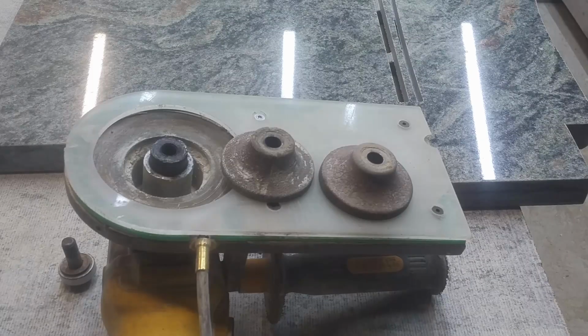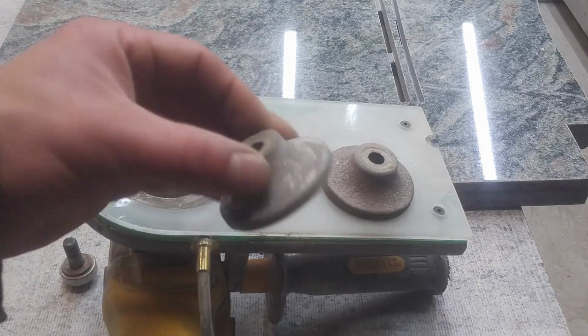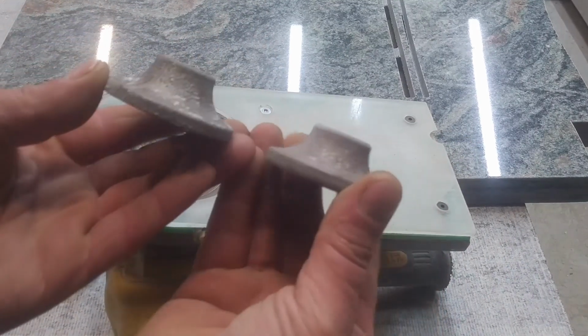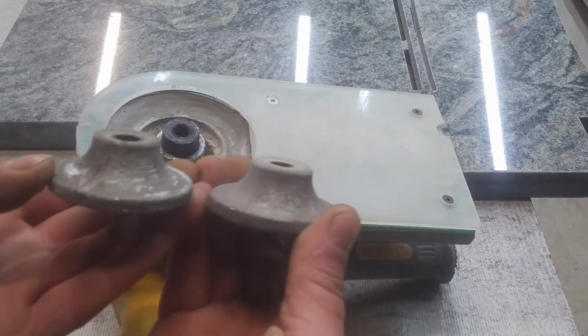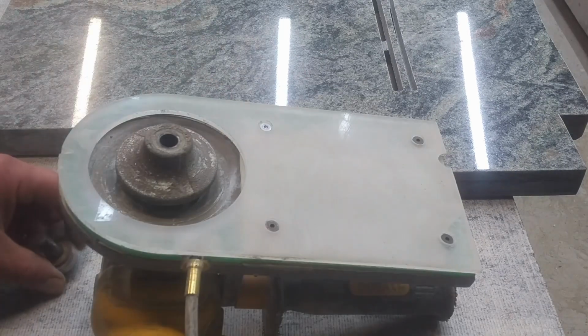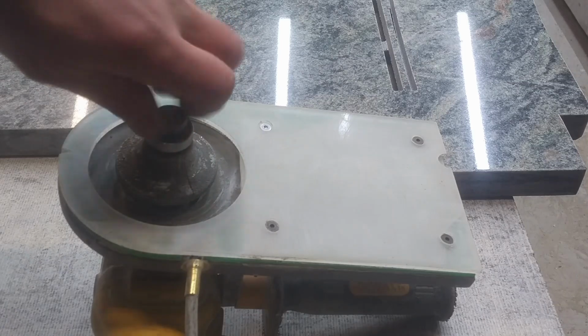I finished the work on the seams. Time to chamfer the front edge. And in this case I will do it with this angle grinder attachment. In principle, this device turns the grinder into a router. I use diamond coated chamfer mills. In this case, first one for roughing pass and the second for finishing.